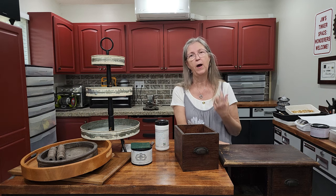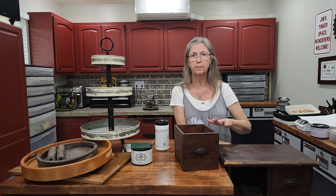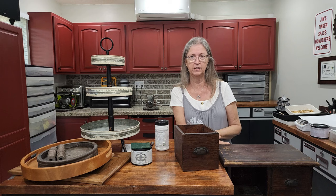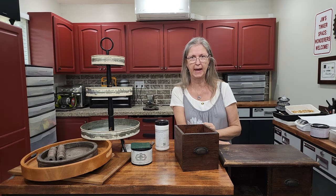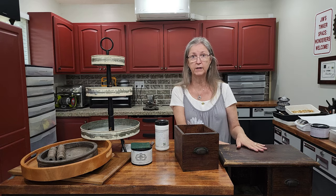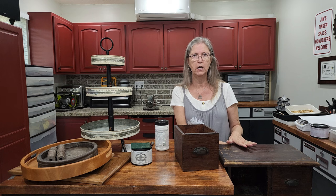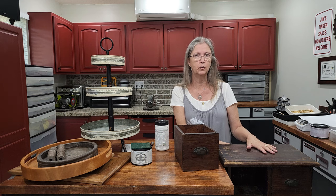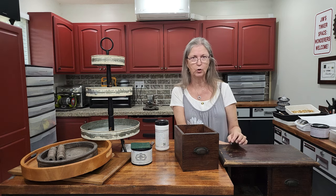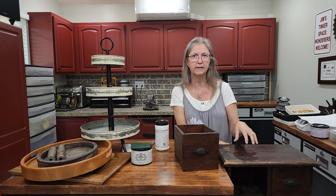The paint is self-leveling, but you have to understand the difference between self-leveling paint and self-levelers like for concrete. When you pour something on concrete to level out and fill divots in a floor, it fills and levels to a flat surface. When you're talking about self-leveling in paint, what you're talking about is that the paint dries to exactly the same thickness over whatever the surface is — whether it's bumpy, has gouges, or is perfectly smooth. So whatever your surface looks like now, when you paint it, it's going to look like that again. If it has gouges or big scrapes, those are going to show, and every additional coat of paint will accentuate them even more.